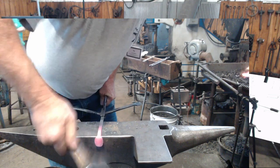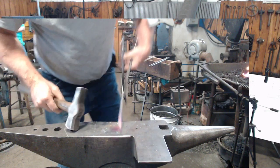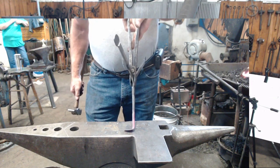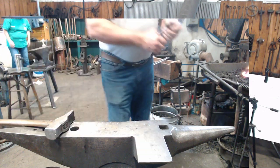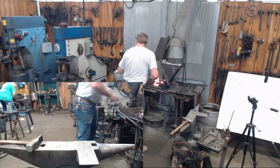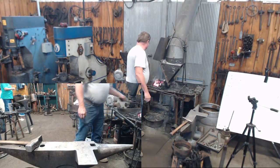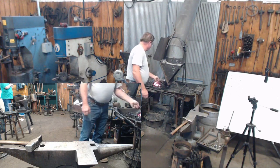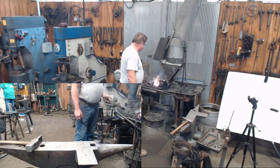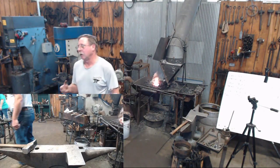And again, take your time, back that foot up into your leg material so when it sits on the table, you've got a nice place for it to sit. I'm going to go ahead and do these other two at the same time before I bend the legs. And it always works out better if you bend all 3 feet the same way. So that's on the table, much nicer.